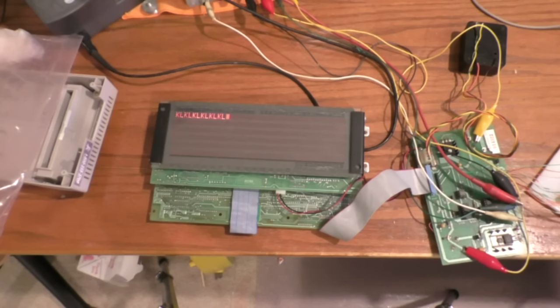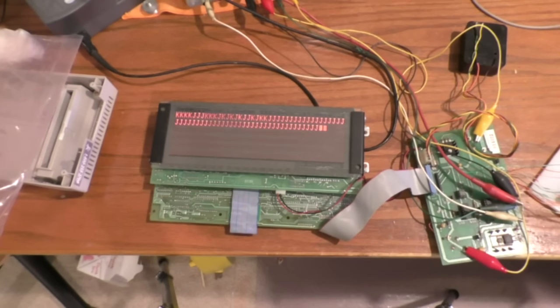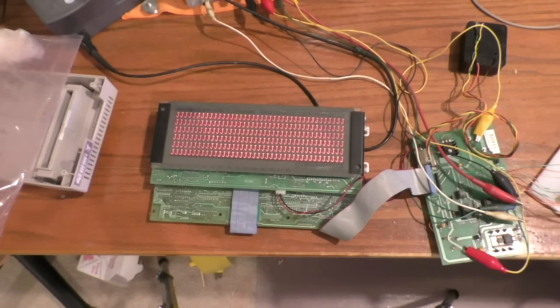I don't know what Alt-14 does - oh, that's also home. Alt-15 is like an insert. You can see it takes a little while - the microprocessor stops, moves all the data, then starts scanning again, which is why one of those scan lines showed up fairly bright for a moment. Alt-16 removes. If I fill the screen all the way up and then do some Alt-14s and 15s, those seem to be inserting a space. Alt-16 takes it away and deletes whatever's on the right side.